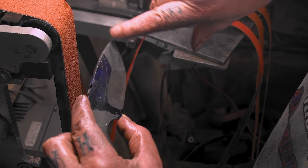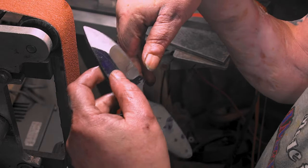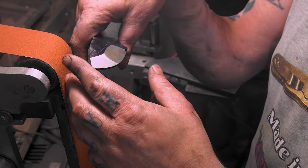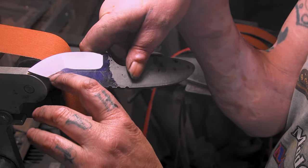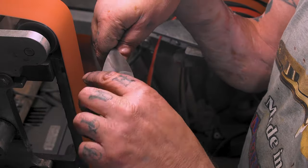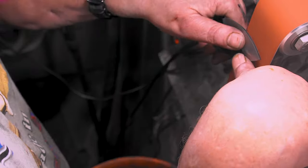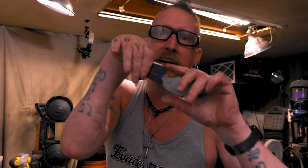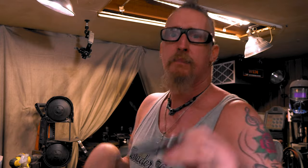I stopped paying attention for a little bit and it got away from me, but that's alright — that's just superficial, that'll actually come down. You can actually see the line is right here. Yeah, 120 and I'll surface grind and make it look all good for heat treat. It's like 2 a.m. I took a marker and marked down here just so I knew where my line was, so we can make that even.